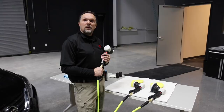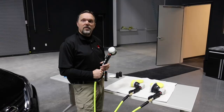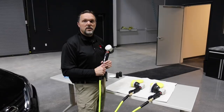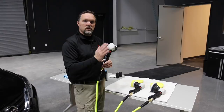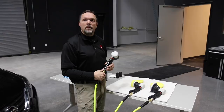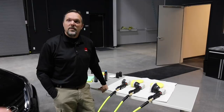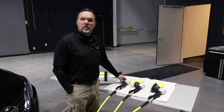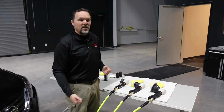Comparing the LHR 75 pneumatic to the LHR 75E electric version: the pneumatic has a 15mm orbit versus 12mm on the electric, and the motor runs at 11,000 RPM versus 5,000 RPM on the electric. So the pneumatic is more powerful for multiple reasons — sheer motor speed and larger orbit. They complement each other rather than replacing one another. You could have both, though if you have air compressor access, the pneumatic tends to be the preferred pick.